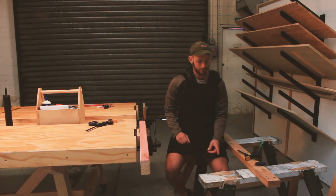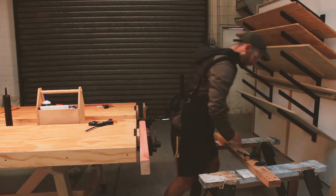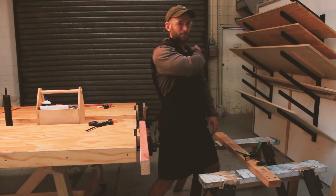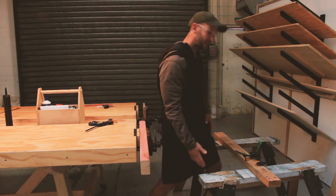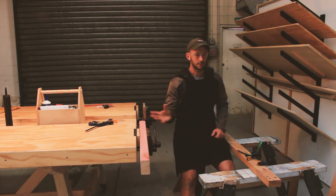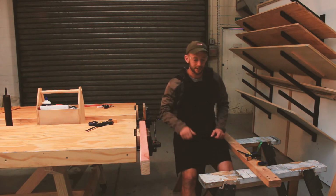I like the height of the sawhorse actually, because you can get over it, and we'll talk a little bit more about that in the body position section. But you can get over it and use your body's position to manhandle that saw, but not to that point where you're working it really hard. You just get yourself in that optimum position, and that's 733 millimeters off the ground on a 12-degree angle. So if you just get out simple Pythagoras, you've got to figure that one out in terms of vertical elevation.